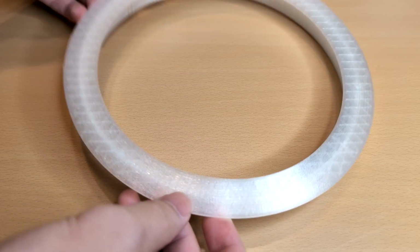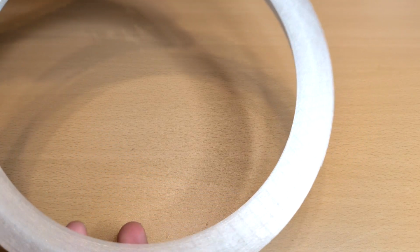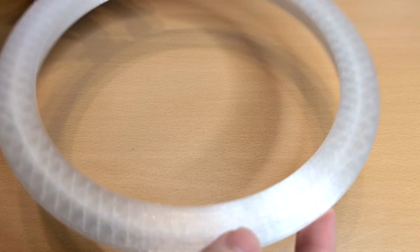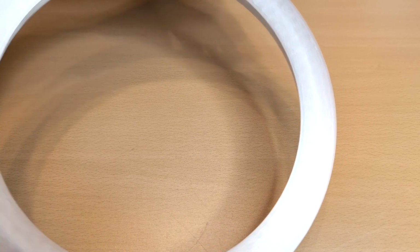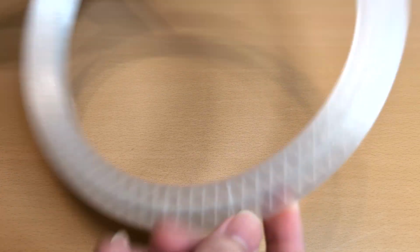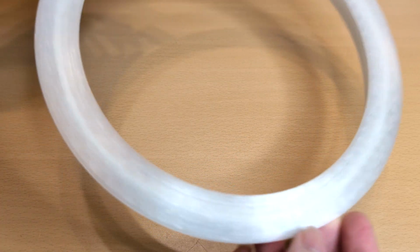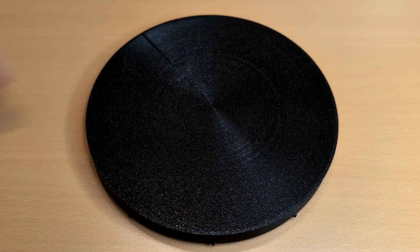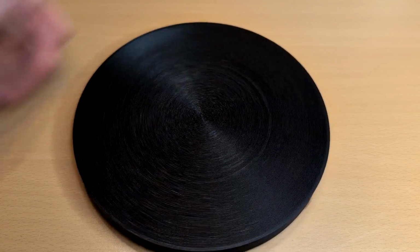The top side of the stand has a rotating platform and a light cover. I used the texture side of the PEI sheet with the concentric pattern at the bottom layer. The outcome of both parts shows the texture and paths of the tool head. Especially the black platform, which has reflective radial lines under the light.